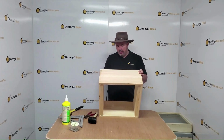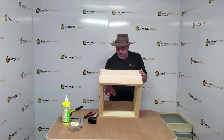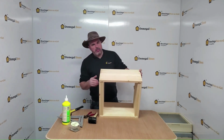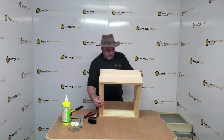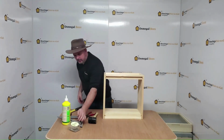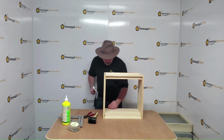The only other thing we haven't done now is we haven't nailed the inner wall to the bottom side rail here. So we're going to put a row of nails along here. About 4 in each is enough. Now, something I may have forgot to mention now, but it's 1.5 inch. It's 40mm galvanized oval nails we use for this process. So if you are looking for nails, it's 40mm for national boxes. So we're just going to put 4 along.